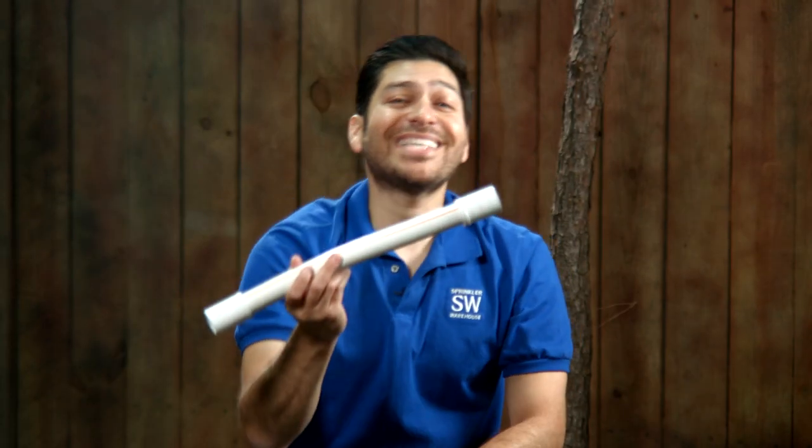Now this bad boy right here is 18 inches long, so you could use it to repair a fairly sizable break. But it's not to be used for hot water or drinking water — it's strictly for underground irrigation use. This flexible repair coupling is also not suitable for constant pressure, which means you shouldn't place it in line upstream of the valve in your system. It is, however, capable of being installed in locations where the pipe is only pressurized when the sprinkler zone or section is running.